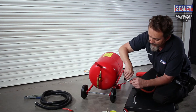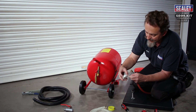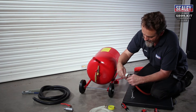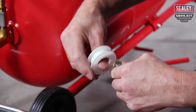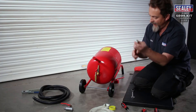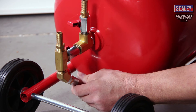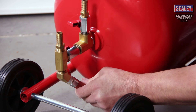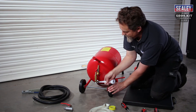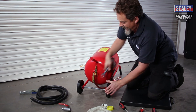Now I need to apply the airline hose from the bottom first. It had some sealant on here, so again I'm going to apply PTFE tape to it — as before, in the same rotation as the thread. Now we can screw it into the manifold and then tighten using the 17mm spanner again. That's now completed.